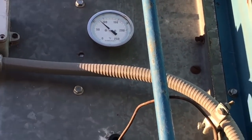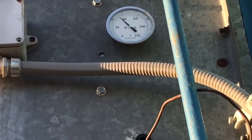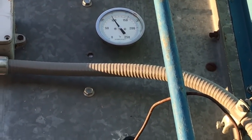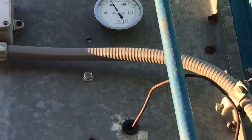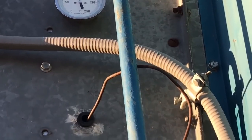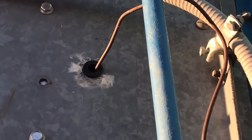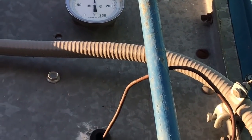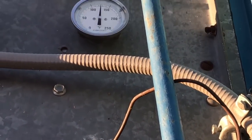It was at 50 degrees. We're probably going to aim to run it around 200 at the least with 25% moisture corn, probably closer to 220. We'll let it warm up. We'll probably take it to about 170, 180 and try to stop it there. I've got a hand valve down here and then we can kind of crank it up from there.